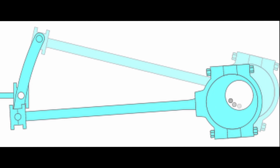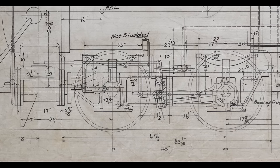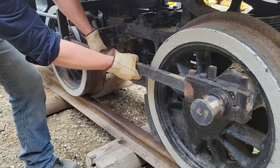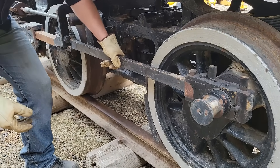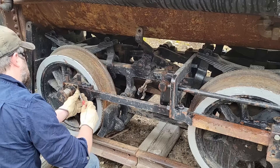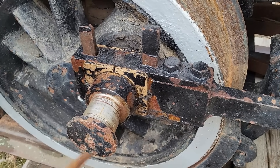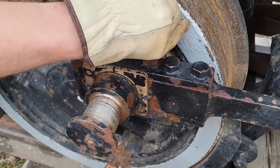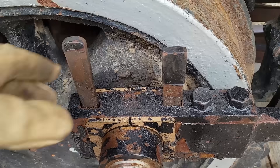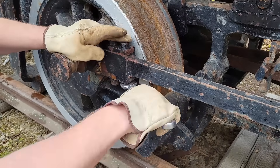Each eccentric is in a slightly different position on the axle and serves the singular purpose of operating its side of the engine either forward or reverse, albeit in one direction only. The left side rod is solid, having zero lost motion in any direction, whereas the right side rod has all sorts of slack. This can be caused by a multitude of things, from plain old worn-out rod brasses on the right side or overly tight brasses on the left, to something much more complicated like the engine being out of tram.